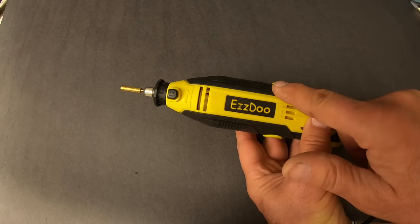Nice. Now I'm going to check my depth gauge again. Check the rakers or depth gauges on the chain. Yeah, they feel pretty good. I took these down. Yeah, they're right where they need to be. I took these down last time I sharpened, so yeah, they're all below, just below. I can just start to feel them peeking up there.